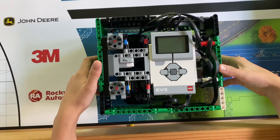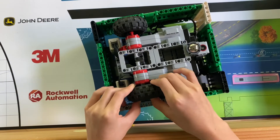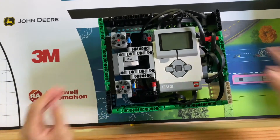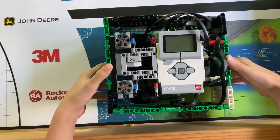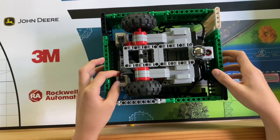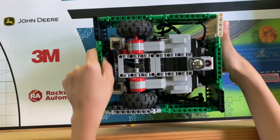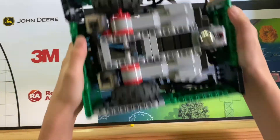Another thing is the position of the wheels. Last time my wheels were in the back, but this time my wheels are in the front. Wheels in the front can help a lot with obstacle missions, and front wheel drive is very important for a robot — with back wheel drive, you won't likely be able to get up missions such as the bridge in FLL City Shaper, shown here. I have dog gears for attachments, like many FLL teams do. And taking one last look underneath, you can see that my medium motors are placed in a way in which my wiring is very easy to get to, and so is mostly everything else, except for my gyro sensor. But for that, I can just take off this base plate here. I decided to use this type of chassis because these O-beams are extremely stable and allow my robot to be very strong.